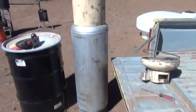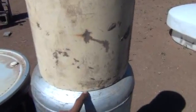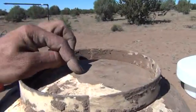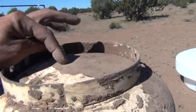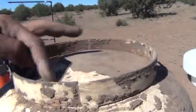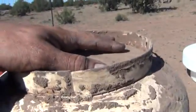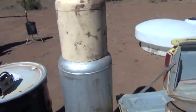Since we've got the top of that cut off, we've centered it and set it on our larger tank — that's going to be our volume tank for our mass and wood, the larger gray one. This one's our reduction zone, the first of the reduction zones. We're now going to mark that out and cut the gray tank so it's the same size going into this, weld the two together, and then take a three-inch hole saw up here. I'm going to make a three-way mark, leave about a half-inch gap all the way around with a small amount of material in the center, and take three holes out with a two-inch hole saw, leaving kind of a pre-screen area with two-inch holes. That'll help make sure material isn't dropping into the ash screen below too quickly.